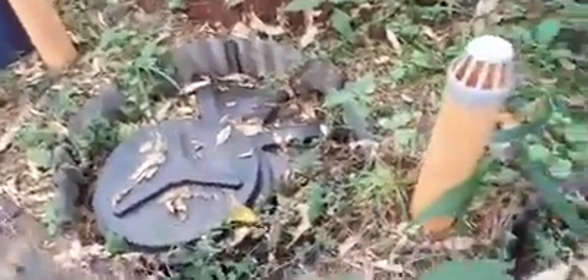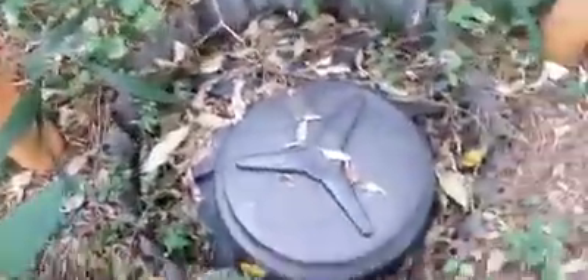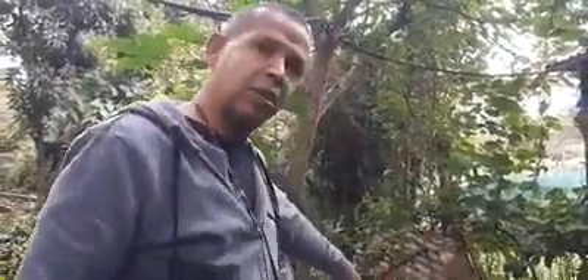It moves to this tank, and then there's another plunger, and another tank. These tanks are 500 liters each. The system is designed to handle about 30 people per day — it's a total of a two-cubic-meter digester plus the separator. There are four tanks plus the separator, making it a five-stage system, and they can be located quite close to the actual toilet.